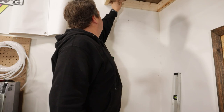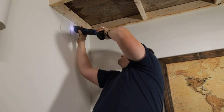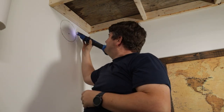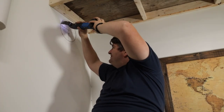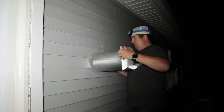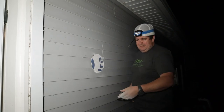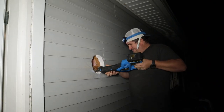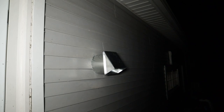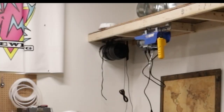The next thing we're doing is getting the ventilation going. First I found the studs, drew a circle, and in the center of the circle I drilled a hole clean outside of the house. Since I'm using an 8-inch vent, you can't really buy a nice hole saw for it — well, you can, but it's probably a little more expensive — so I just used my cheap old oscillating tool and cut the drywall out. Then I moved to the outside of the house, measured it, and used the vent as a template to draw a better circle. I used the angle grinder to cut the siding, because it makes a lot cleaner cut than an oscillating tool or reciprocating saw. Next I took the Olfa knife and cut away the Tyvek and the foam — about 2 inches of foam before getting to the plywood — then used the reciprocating saw to trim out the plywood and fit in the vent. Once the vent is fit in there and everything's finalized, don't forget to caulk on the outside — I used a bunch of silicone caulking for it.